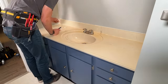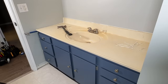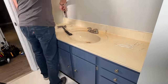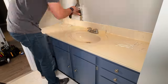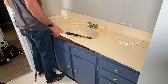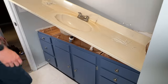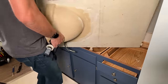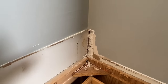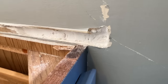You might need to get a little more leverage with a pry bar or small cat's paw. But remember, do not just press against the front face of the vanity — you want to make sure you have a cross member in there. I'll go along the back side making sure it's broken loose, and then finally pull it up and out. This is pretty heavy so you might need a little help getting it out of the bathroom. A big issue for me was that the vanity was actually inset into the drywall on the right-hand side, which is why I was having so much trouble removing it.